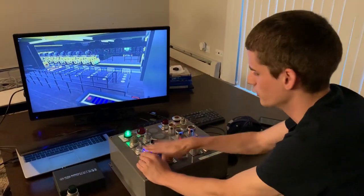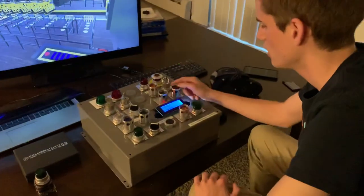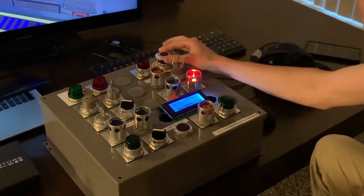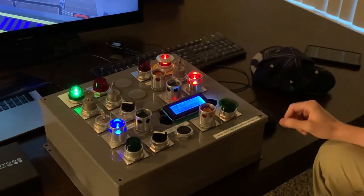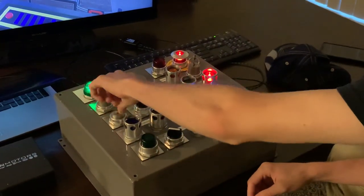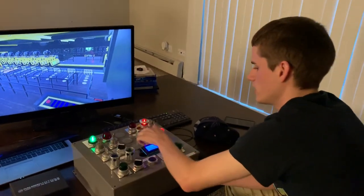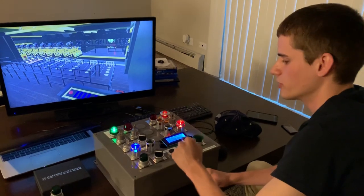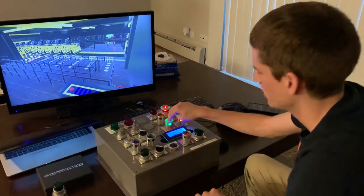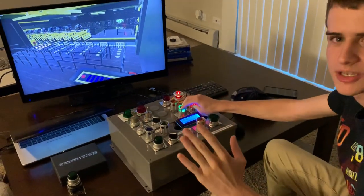Let's turn the panel on and put it into automatic. Here we got the lamp test — this shows the lamp test right here. Down here we got acknowledge — let's acknowledge that all the lamps are working, of course, because it's maintained by me. Then next we have the stop test. We have to test that all the stops are working, so let's test that ride stop and the e-stop. Then we continue to the next step and acknowledge that the ride area is clear, giving anyone in the area ample warning that the ride is starting.